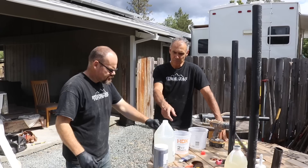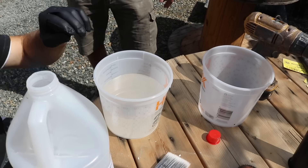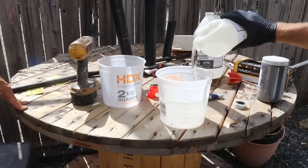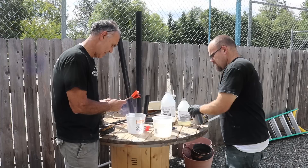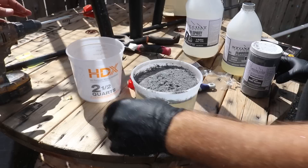It's a two-to-one ratio on the flooring epoxy — it's a thinner product so it'll go further and roll out easier. Two parts A to one part B, just like our casting resin. Use the graduated buckets on the side — go up to the four-mark for part A, then add part B to the one-mark. It makes measuring a lot easier — it's not rocket surgery. Shake your metallics before you open them to break up the pigment, so it's easier to mix.